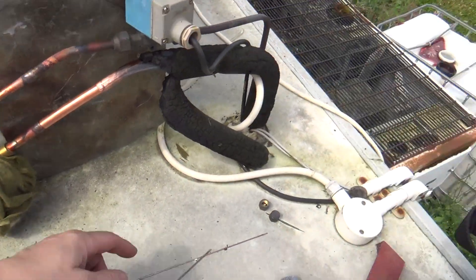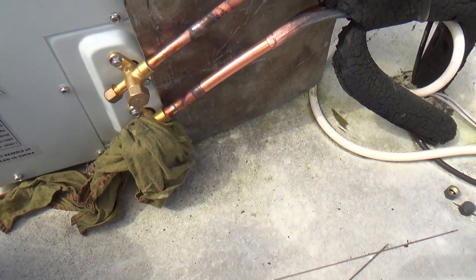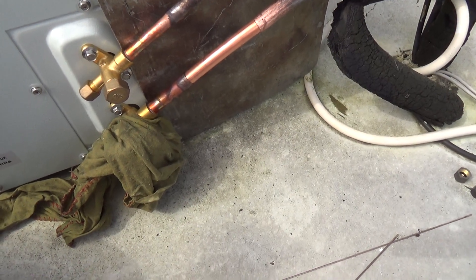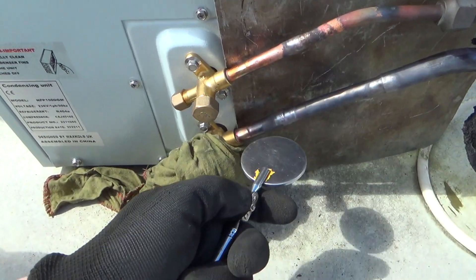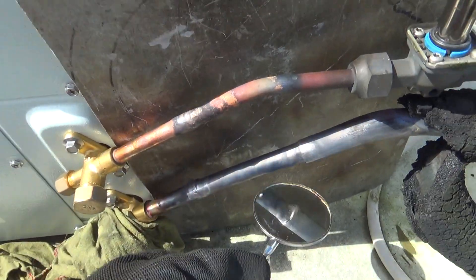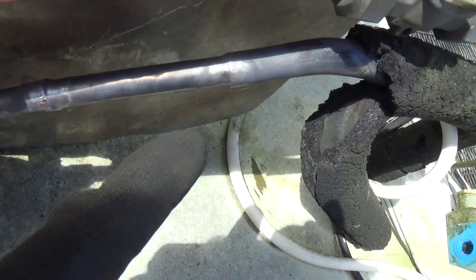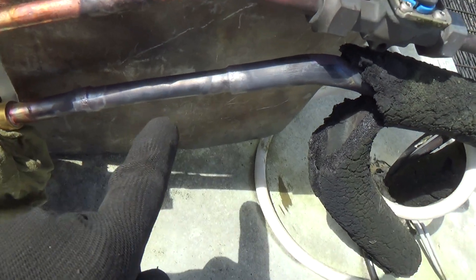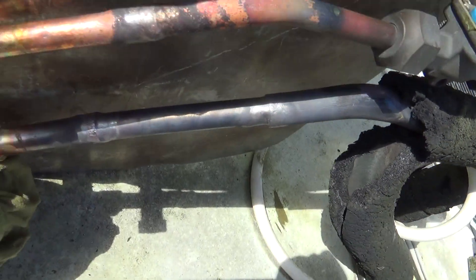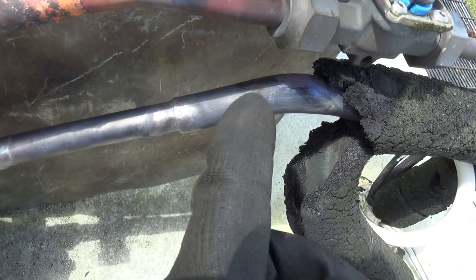Back it, charge it, we've got to wire it — it's a simple wire, we've got that wire there. Fingers crossed. Okay, that's M2. That one went a bit better. It's full because we chucked half a stick into it. I had the torch a bit too hot and it sucked all the braze up so I didn't get a nice little fillet, but it's got enough in there to be leak tight and the pipe's sleeved in about a good inch.